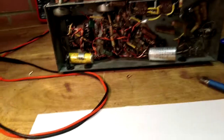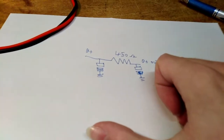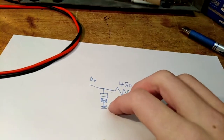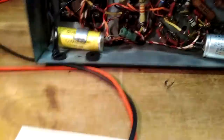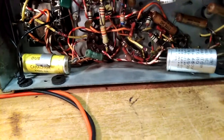I'm not sure how hot it gets — I think that might be a 2-watt package; it probably dissipates a little bit of energy. Anyway, that's the topology they use. Some of these radios use it; I'm not entirely sure why they can't use a choke, other than for cost reasons. It feels like there's plenty of room to mount one. Perhaps I could experiment — I have got a choke I could show you; I think it's 40 Henrys at 100 milliamps.